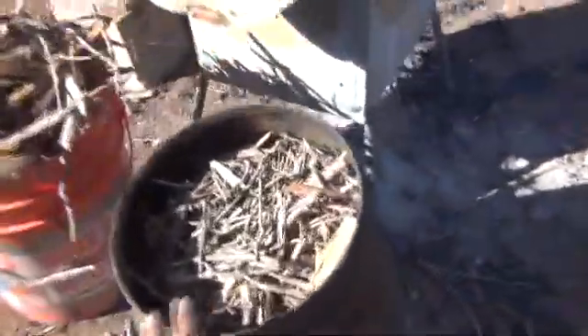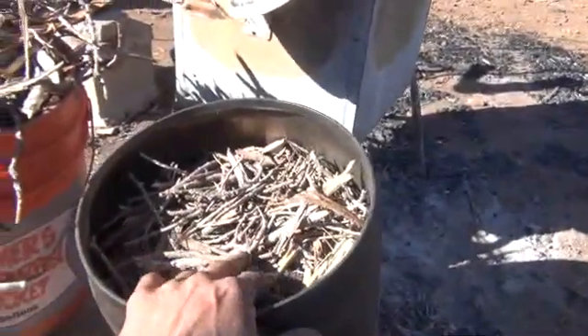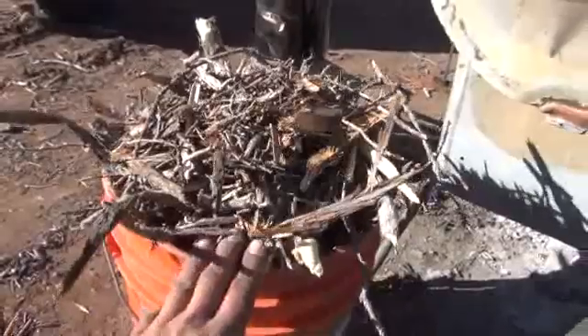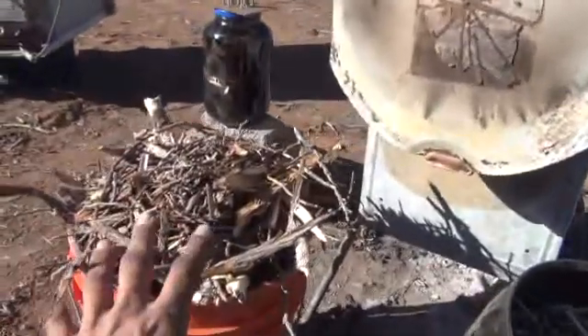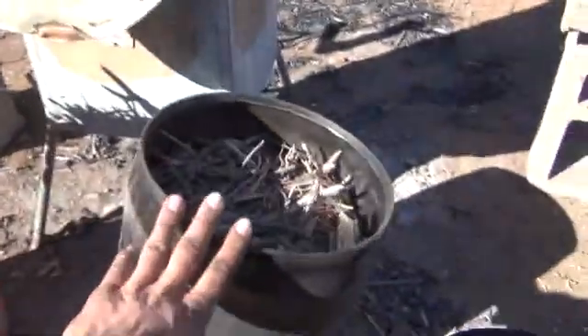Here's what we've got for wood. I've got the biocrude production can, the synthetic gas production can, the reactor full of a mix of greasewood, juniper, and oak. A couple of cow pies inside of there, nice and dry, just to add some more methane content. We have a bucket full of wood that we're going to use to fire up the wood stove itself, and that'll give us the heat for both the thermal cracking unit on the biocrude production system and the thermal cracking taking place inside our reactor.